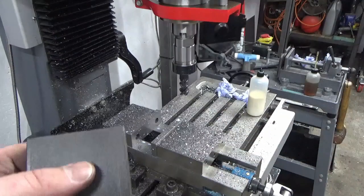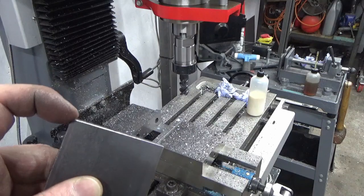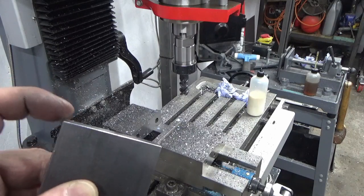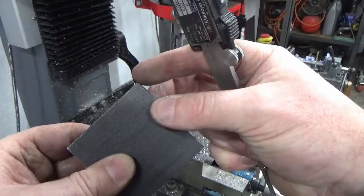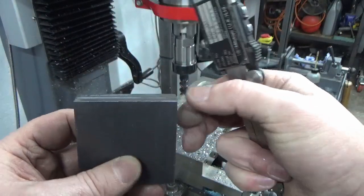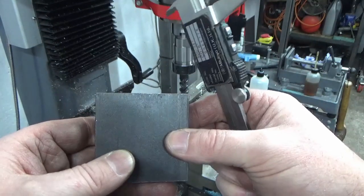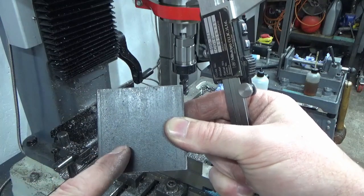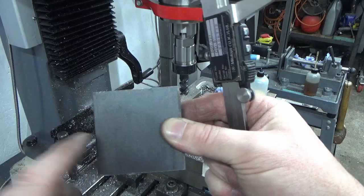near enough. So next job, now I'm just going to check my radius cutters, see if I've got, these blocks should have a 5mm radius on the corners here. If I've got a radius cutter the right size, I might see if we can drop these rads on now before we go to the lathe. If not, when we come back, you'll be joining me on the lathe as we're setting the first one up to start putting the turn features on.